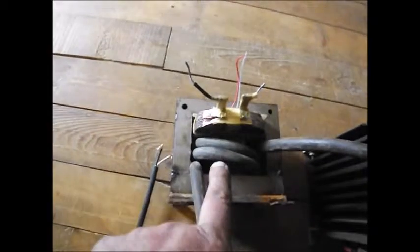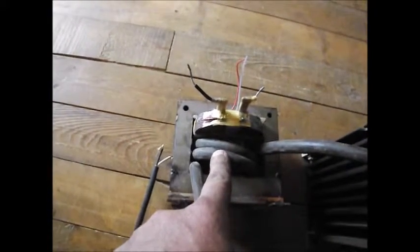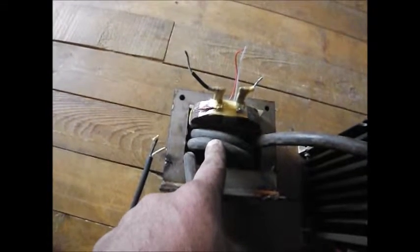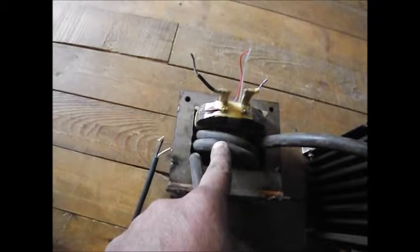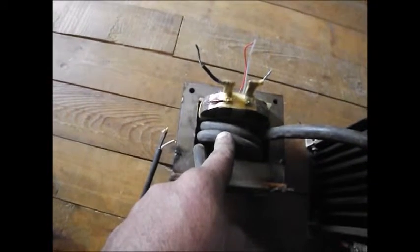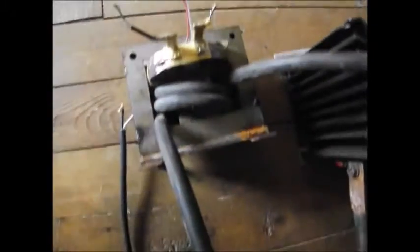The secondary coil is only producing — I'm only getting actually 1.24 volts if I remember right — and that's just not enough for a 2-volt cell. We're talking about a high amperage, high amp-hour cell here; not anything light duty or small time. This is pretty large scale.